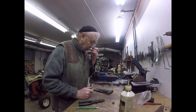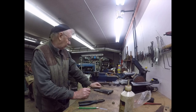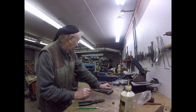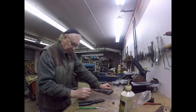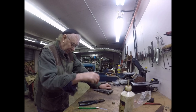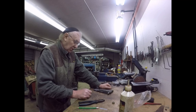So now I'm going to put a vise on the milling machine, and I can now put the half inch milling tool holder in, use the taper on the milling holder to align the former in the vise centrally above the milling head, and then I can fit the boring head, and we'll have a go at boring it out. But first, I'm going to have a brew.